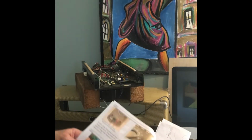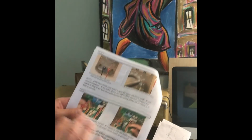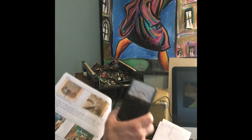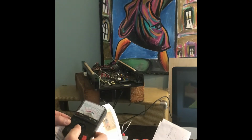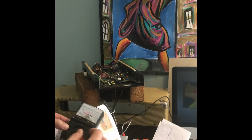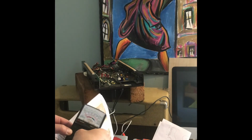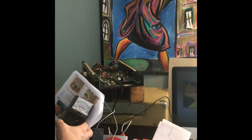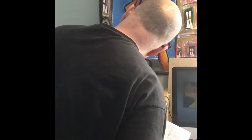So we basically want the standby, is it still filming? We want the standby to be out of the circuit. We're going to use this meter and we're going to use it in amps, DC. So here I have a selection for 10 or 250. I have no choice, but I have to put the 250 on. And we're going to want to go across the standby switch.